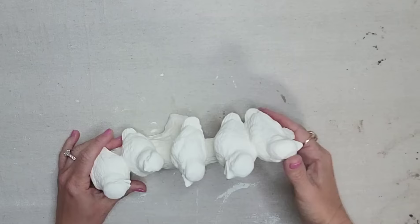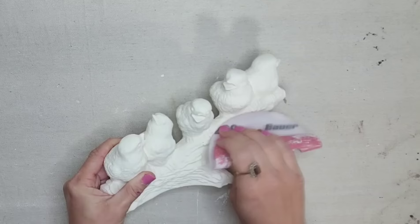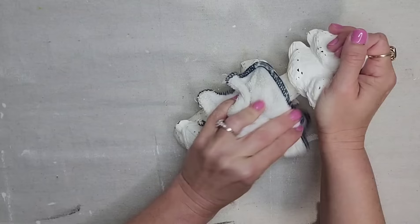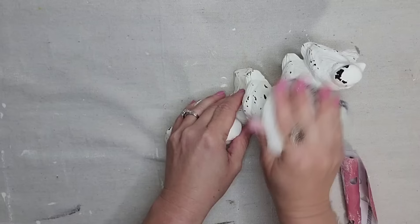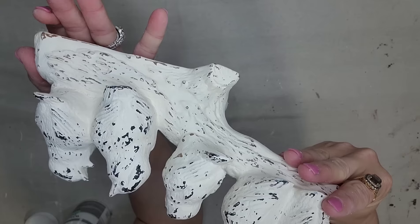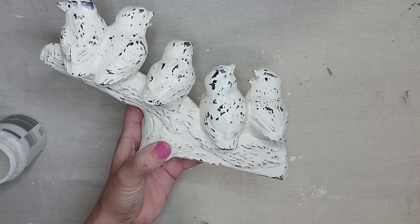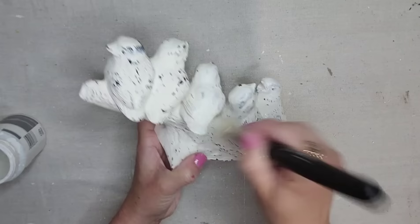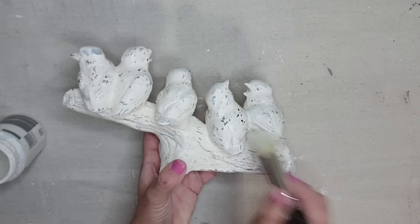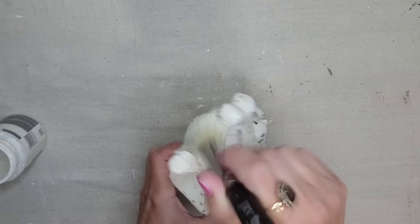These birds actually look very beautiful — simple and white. But I want to give this piece a more aged distressed look. So using a combination of 220-grit sandpaper and a wet rag, I'm going to distress back some of those details on this piece. I love the chippy look that the combination of sandpaper and wet distressing created, but for my personal taste there's just too much color difference between the dark colors underneath and the white paint. So I want to tone it down slightly by adding some white wax on the entire piece — I'm not going to wipe it off. I'm going to leave it on there so it tones everything down and brings all the colors together while still keeping that aged chippy look.